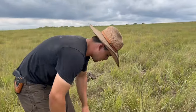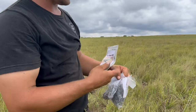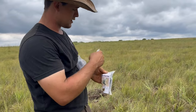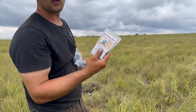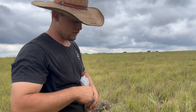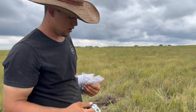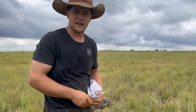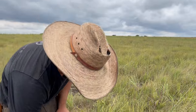And then we've got our clips. I've been using these — the tag's kind of missing on this one, but it'll say Willie Kilmer clip from PowerFlex. Those are the ones you want — for steel wire only. They're stamped spring steel and they're kind of a pain and they're sharp and pokey, but they're the best things for hanging on to this steel wire.